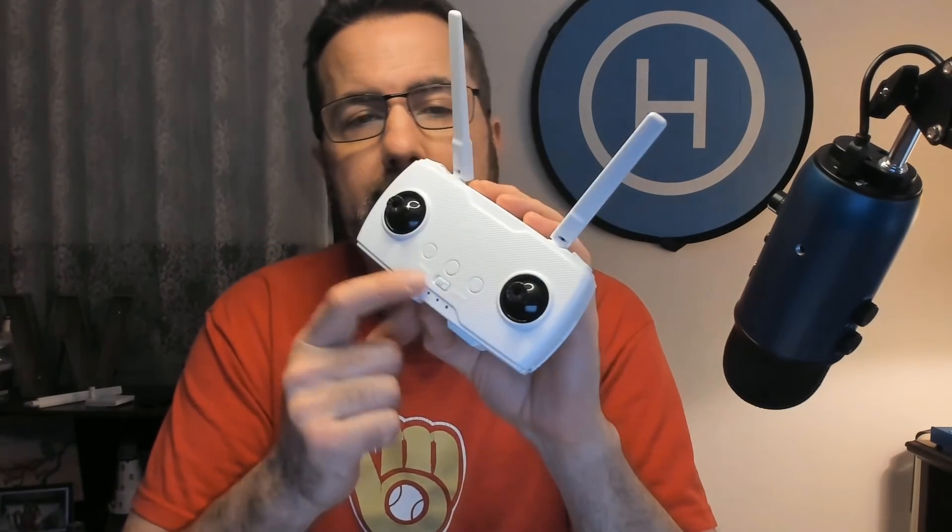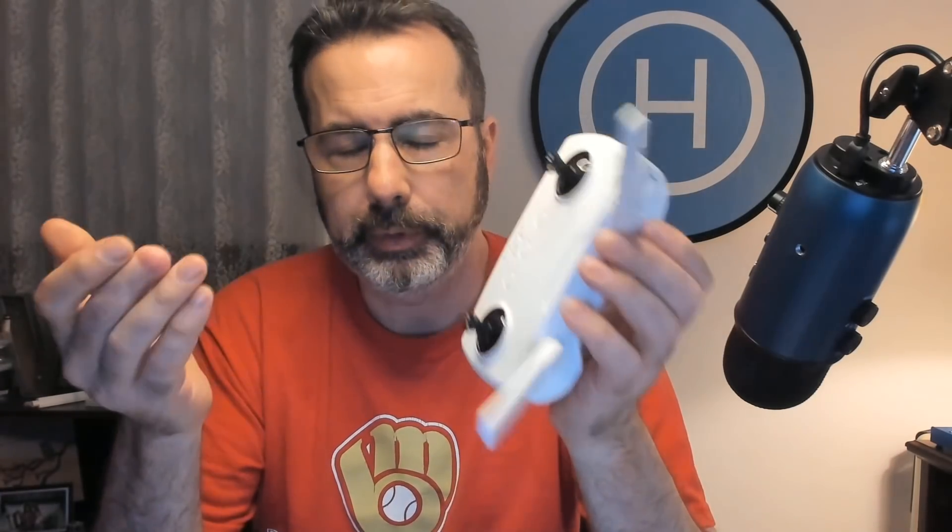On the controller, turn it off, unhook it, and pull your jumper out. That's it — this will resolve the problem of being stuck in that boot loop. For safety, re-update the controller and then you're good to go. You'll be able to connect between your device and the controller. If you can't connect to the quad from there, you've made an error updating your gimbal or camera firmware — most mistakes are made when updating the camera firmware, such as not formatting the SD card as FAT32.